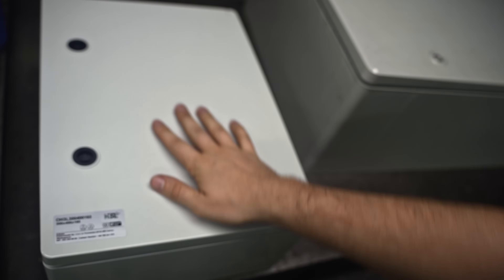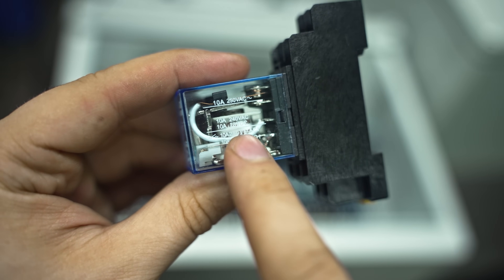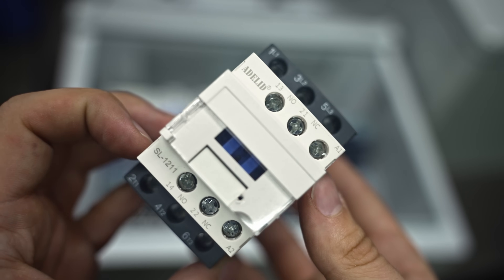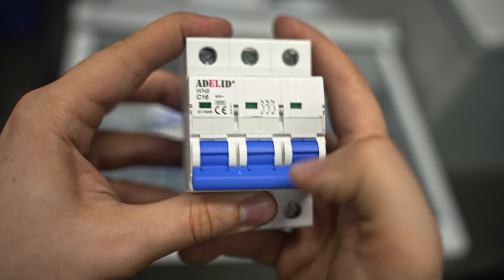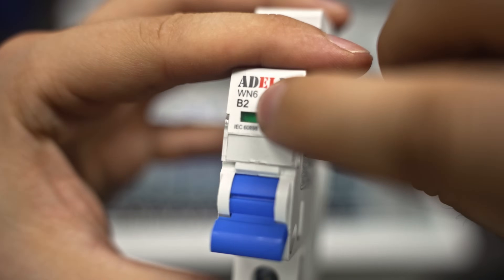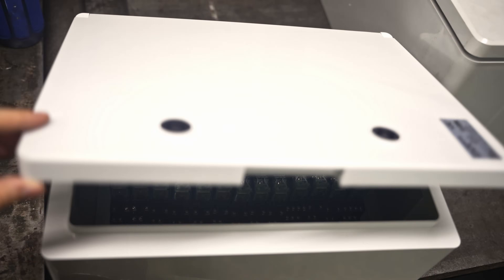There is also a smaller box where some old school magic happens: protection breakers, then contactors for some further electrical control, and a lot of relays. I personally think this might be a little overkill for such a machine, but I think it will make sense. Those little guys are powered with 24 volts from the bigger PSU. The contactors for shutting down parts of the circuit are powered with one-phase AC voltage. I'll use a 16-amp breaker for the three-phase spindle drive and a 2-amp one for the main contactor, with 6-amp delayed breakers for the X and Z axis servo drivers.